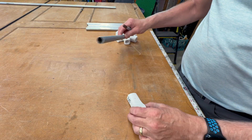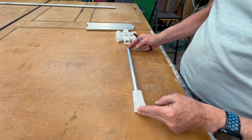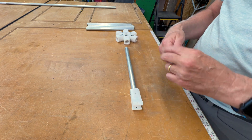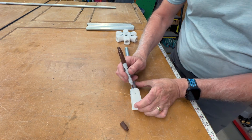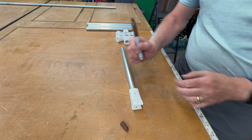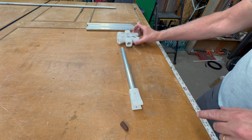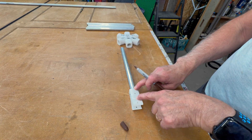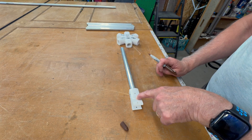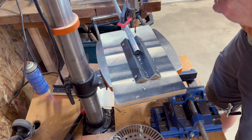To set up the EMT for the bottom hub, I'm going to slide the EMT through there, take a Sharpie and mark my hole, then drill that out. After I get the M4 screw in here I'll do the back side — that way everything lines up and stays nice and even. Then I'm going to drill the next hole, set up in my jig, and clamped down.